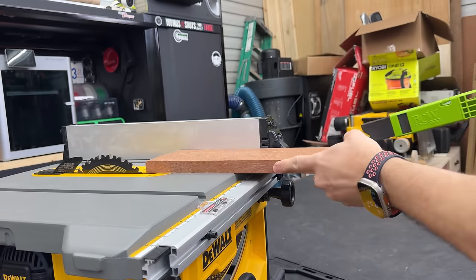If you need outfeed support and don't have an outfeed table, one of the best tools I saw in 2023 was the Bow extender fence. It comes in three sizes — the 36-inch is a great option. It keeps boards from falling off the back with outfeed support, and you can also use it for in-feed support. You can attach featherboards to it for vertical pressure to keep boards from popping up. It clamps to any fence you already have — job site saw or cabinet style — and can be used on your band saw too.